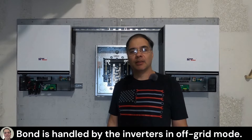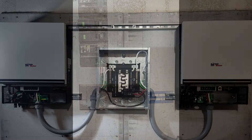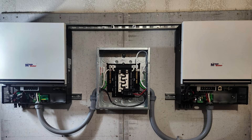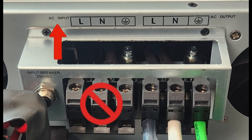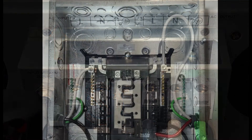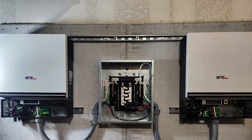I'll post a link to a video that explains ground neutral bonding in detail in the description. To review: your main service panel already has a ground neutral bond. The inverters have internal bonding screws managed by the internal ATS switch. When using grid power for bypass or AC charging, the bond is broken. Ground neutral bond must be established in a single place only, typically nearest the main service disconnect. If your system is totally off-grid with no AC input, you can place the bond in your subpanel — but you must remove the bonding screws inside your inverter first.